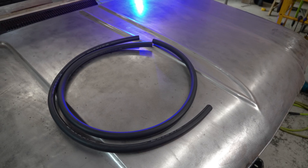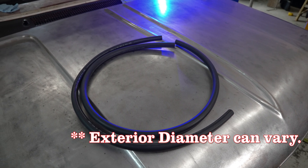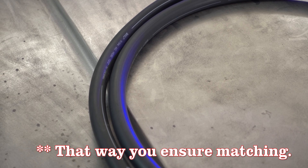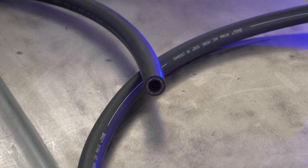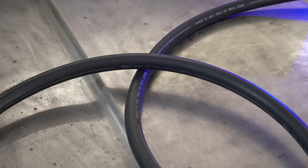When we assemble the line, the next component to discuss is the actual hose itself. You have various sizes, and there can actually be sub-sizes within sizes that I've run across. It can be a little confusing, so I really recommend trying to work with one vendor when buying all your components — buy everything from Vintage Air, or buy everything from your local AC supply house. The hose should absolutely 100% be a refrigerant hose, meant only for refrigerant. These hoses are multi-layer, similar to a fuel injection hose, with an inner layer, a woven structure inside the layers, and an outer layer. One of the primary factors at play is that refrigerant molecules are just small, so they can actually permeate through hoses that are subpar.